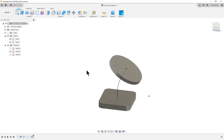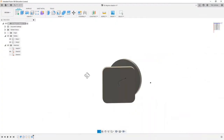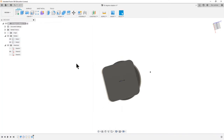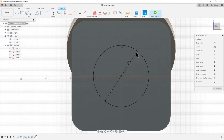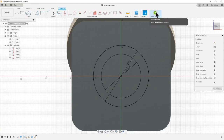The next thing from the instructions is to create the tube in the middle, and the cut through the tube. Those are a 56 millimeter circle and a 40 millimeter circle. I just have to remember those numbers: 56 and 40. I'm going to draw them on this face and sweep them along that whole length. So a center circle — this is 56 millimeters — and another circle — this is 40 millimeters — and Finish Sketch.